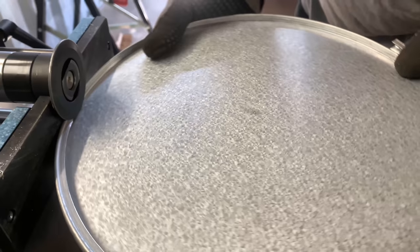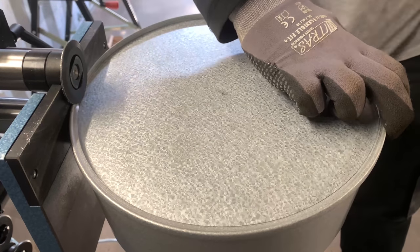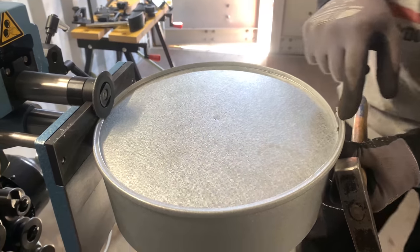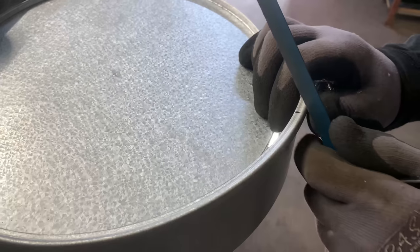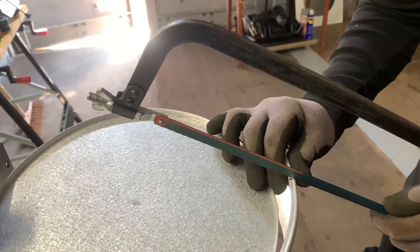Close it up onto a half. So once I have done close up the half, I'm gonna take a hammer only. Do it like this. So we see here we have the overlap. The next thing is I'm gonna mark here where the overlap is. If you see the overlap from this side here, it starts, say, somewhere here. Then I'm gonna take my metal saw, just saw here a little bit, not exactly on the line I marked, a little bit before that.